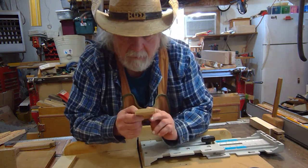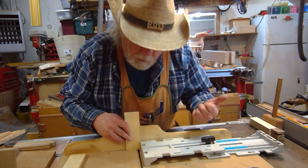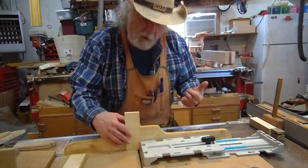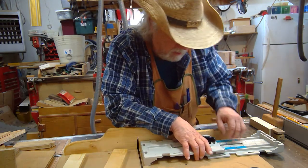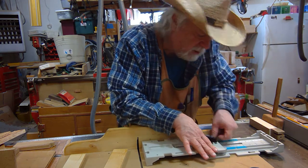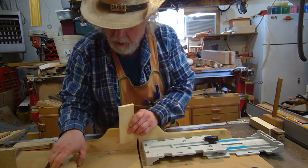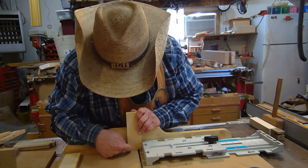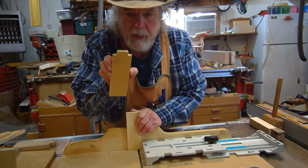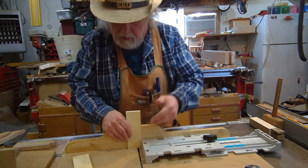Now we're going to cut out the two fingers — they're going to be a half-inch — so we've got to move over. We have a quarter-inch there, so we're going to move it over a quarter-inch, the width of the blade. So we go from a quarter to one-half of an inch, and now we've moved over the exact distance. Now we take this one and we're going to cut it so that we can hog out the center area for the mating connection. So let's go ahead and cut this out now.